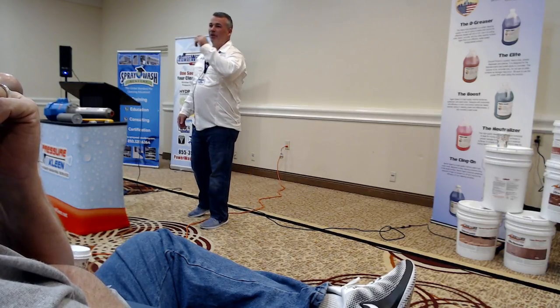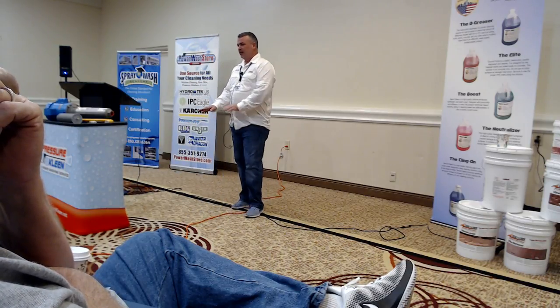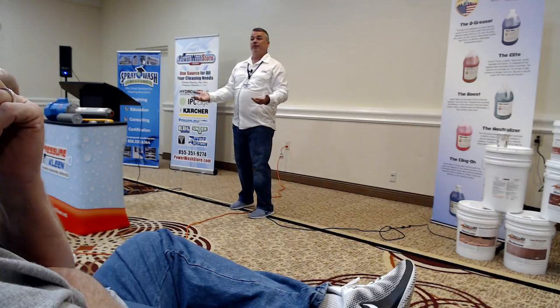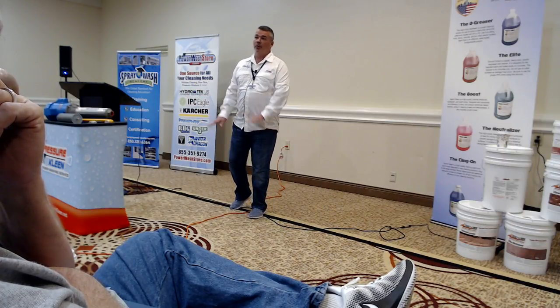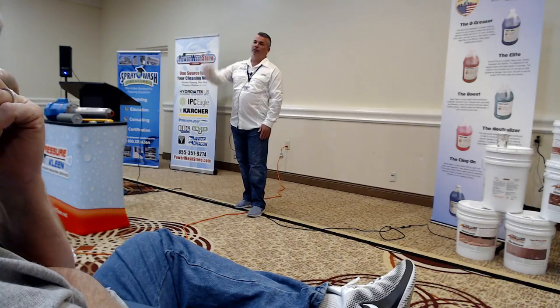One quick one, Brenda. Can you put that motor anywhere height-wise? It's better to have it at the base of your tanks rather than above. Once you get it over the top, it basically siphons and feeds. We've had a lot more luck with them being down low. I put mine under my truck in an underbody box. I've got a trailer and I was going to put it on the tongue. Just put it on the bottom. Don't mount it above the tanks.